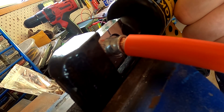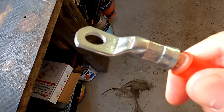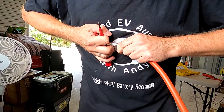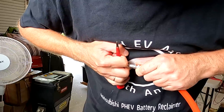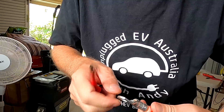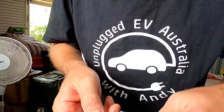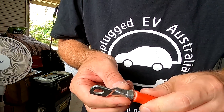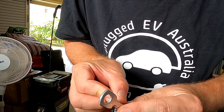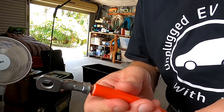Here's the first result — that's actually very, very tight. Now you're pulling the insulation back but you're not pulling the copper out of the lug anymore. 35mm die, 35mm lug — perfect crimp. No excess material, no little fins, no sharp corners — nothing, just clean. Some heat shrink and we are good to go.